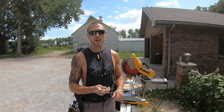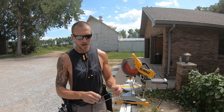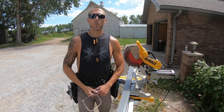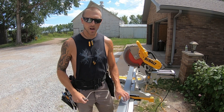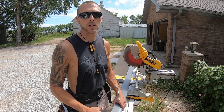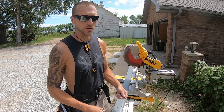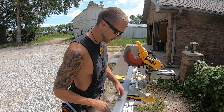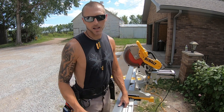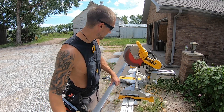You can flip the blade around so it cuts on the pull stroke — I like the real fine tooth blades. Once you have a good coping saw, I like to work with a longer section of trim; it's just easier to hold down. Some people will want to clamp it down. Once you get to the point of coping, the method I like to use is kind of a miter method using your miter saw.